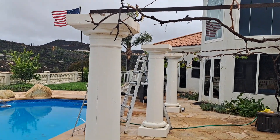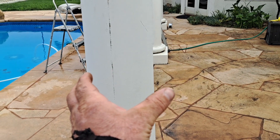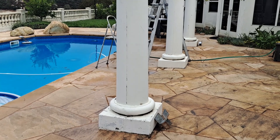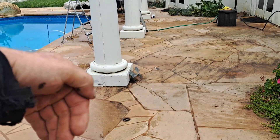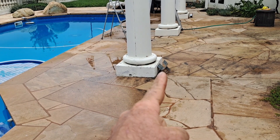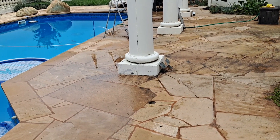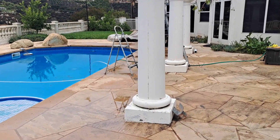I was so ready to put them back together, but I obviously can't. So this is what I learned about these — it's kind of like a concrete base, and then this shell is hollow. My plan right now is to do a few ratchet straps — maybe three — and then take rebar and bend it at the bottom, try to get like a 90-degree bend out of the rebar, and get the rebar all the way down into that hole where there's a footing. There's basically a piece of metal like that one set in concrete — I'm going to shove the rebar down under the rock, probably two or four rebars per column, and then fill this thing totally solid with concrete.